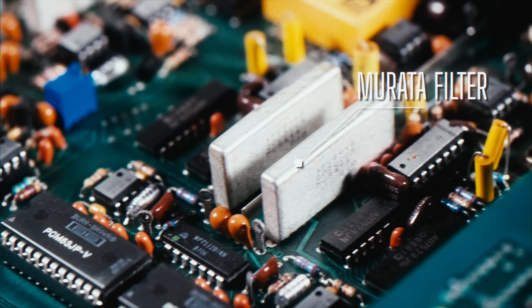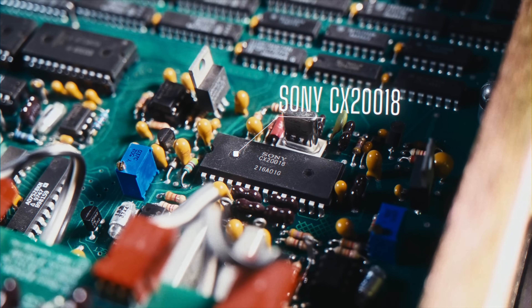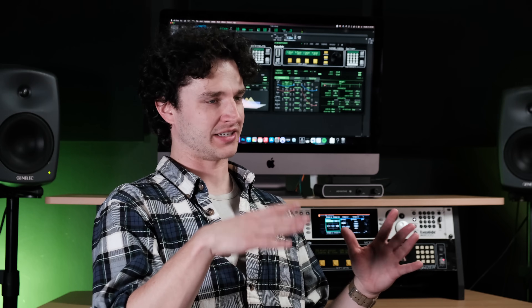There are these special filters called Murata filters — a very steep, high-order analog filter used for going into the converters as an anti-aliasing filter and going out of the DAC as a reconstruction filter. The converter itself was really cool — I think it was a Sony CX20018, and it was one of the earliest, if not the earliest, stand-alone single-chip analog-to-digital converter. It worked in a cool way where you essentially created a digital signal from the analog signal by counting time, so it actually had to alternate the channels it was converting.